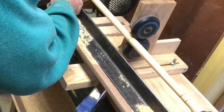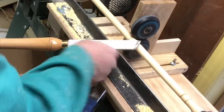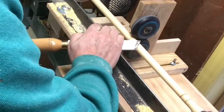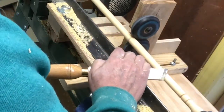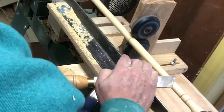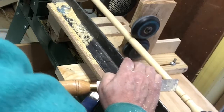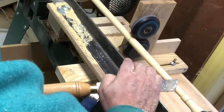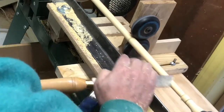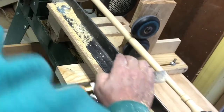I've already measured out how long the drumstick is supposed to be, and I actually designed and built a spindle support system. You can see right there I built it up with some rollerblade wheels and some scrap wood so that it would support the back and sides of it as I'm working the skew tool to make a little taper on it.